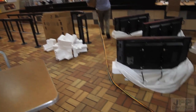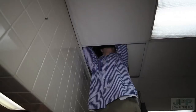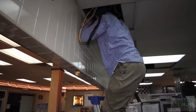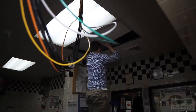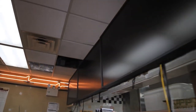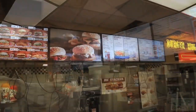Now I'm going to get started fishing the wire through this drop ceiling. I start where the TVs are so I have a starting location, and the end location is going to be in the back office. When going through these drop ceilings, I like to stick the wire to a broom to make it easier to maneuver and avoid other cabling in the ceiling — I don't want to rip on anything. Here I'm tugging; I'll ask for slack to make sure I don't pull on any of the existing wires. Here I'm making my final push towards the back office. Now I'm going to connect everything to the controllers so when I hook them into the displays they're going to deliver the new menu content. I'm poking my holes through the wall so the cables are run, the TVs are hung, I'm going to make the final connections, and here's what the final product looks like.